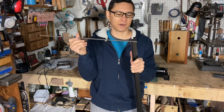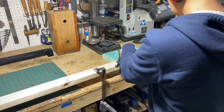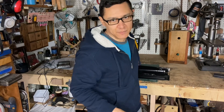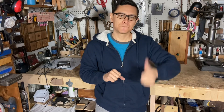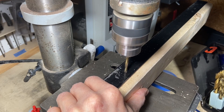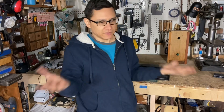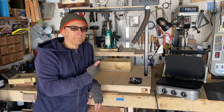The threaded rod drives right into the smallest hole, which keeps me from drilling needlessly. I cut the two-by-threes to the same length — about 28 inches — for the two pieces that will mesh together for the tops and the bottom, for a bit more structural support so it hopefully doesn't buckle under pressure. We'll get any additional holes drilled for the threaded rod, get the skeleton put together, mount the jack, put on the springs, and then put this guy to the test.